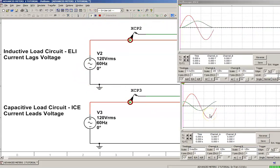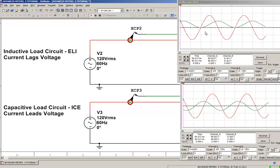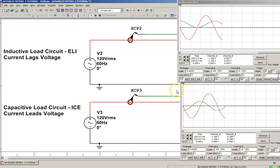This is important because when you bring equipment into plants and set up motors, generators, and transformers — inductive and capacitive loads — you affect the power factor. You affect the relationship between the current and voltage, and you can affect it so much that utility companies will charge you a fine because they're providing you more power than what you actually need. You're not using it efficiently and you're disturbing the power factor. But you can correct it using power factor correction equipment. That's where we use oscilloscopes — to measure the current and voltage phase relationship and then devise the means for correcting it.